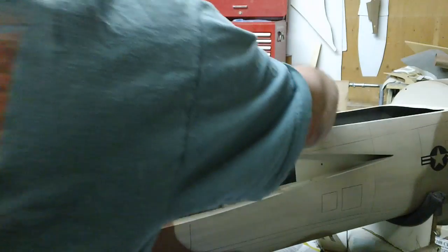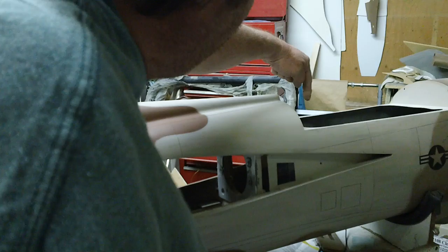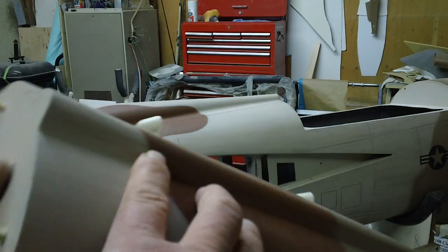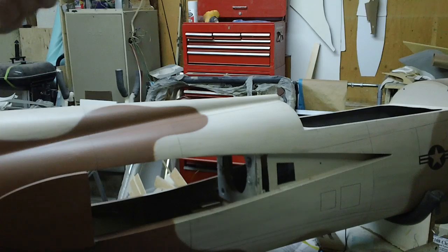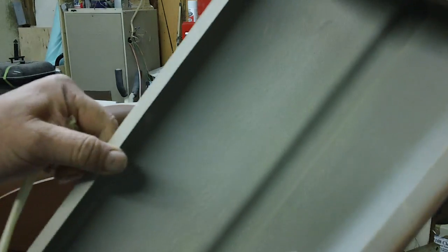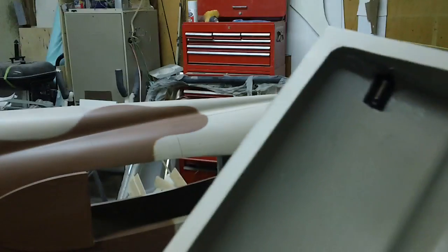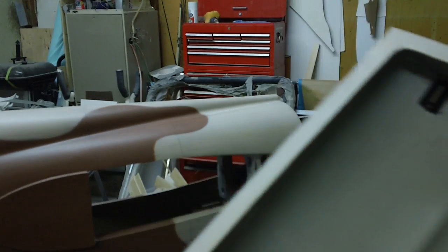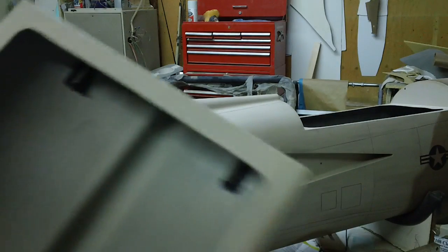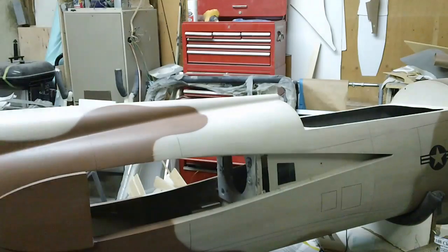You see this one, see that little bit of curve right there? That needs to go straight, bam, right back into the fuselage. Probably go to about this far in my engine cover, and on the inside, I'm gonna put a couple braces. This thing's wanting to spread just a little bit. But on the inside, I can just take some of my glass I already got laid up over there, cut me a strip, do it right across there, upside down, and then layer another layer of cloth over the top of it, and then I could chop all this off. Bam. Chop it all off. And it wouldn't look too bad from the inside either.